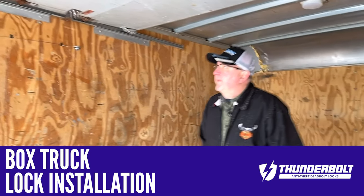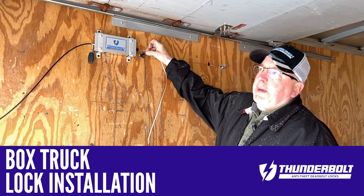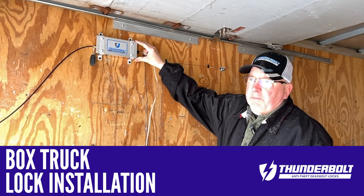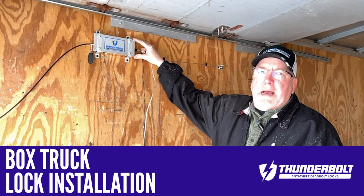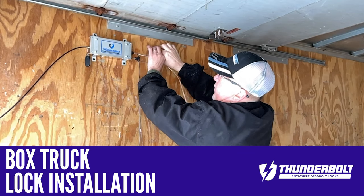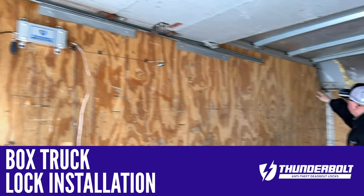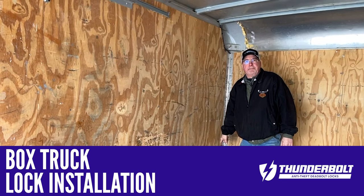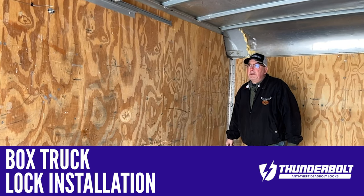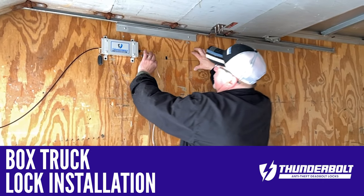On the output wiring of the box itself, you're going to have a blue and a green wire that are going to be the inputs to the lock itself. If you're using our remote control module, you're going to want to mount it very near to this — that blue and green should plug right into the remote control module. Your red and black is going to run straight along and down and connect directly to your battery. There's a supplied fuse holder; you want to make sure that you use that and install the fuse. The red and black power comes up here to the remote control module, the blue and green plug directly into it, and your remote controls operate the lock itself.